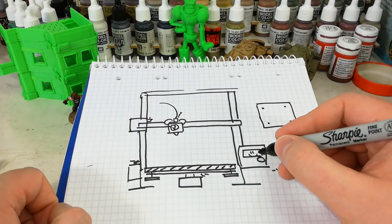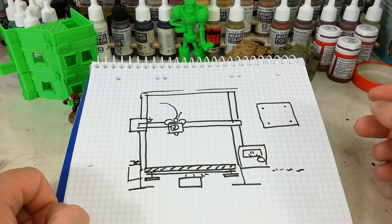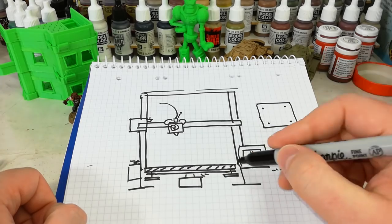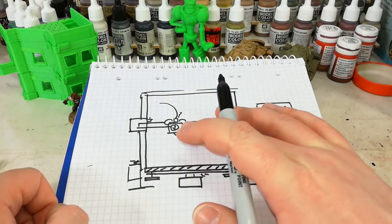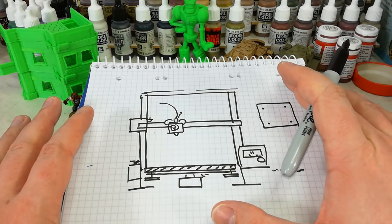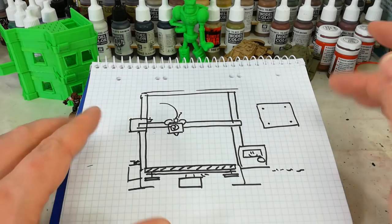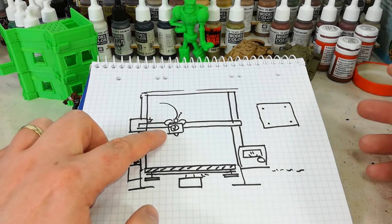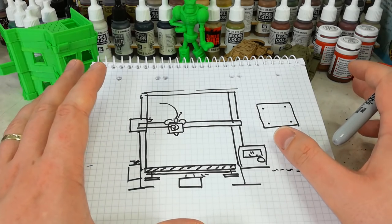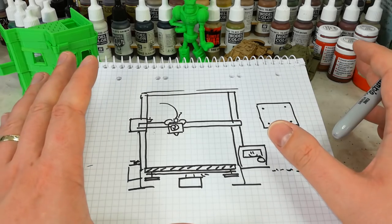Then to start off with, my happy little LCD screen here — you tell the heat bed to heat up and it warms up. The important thing for this: the heat really helps it stick. When you're printing hot plastic, it needs something to stick to so that the plastic layer you've laid down stays flat and doesn't move. Because if it moves, our machine head doesn't know what's up. That's pretty much the ins and outs of the mechanical side of things — it's remarkably simple when you really see how it goes together.